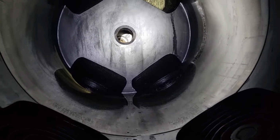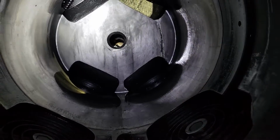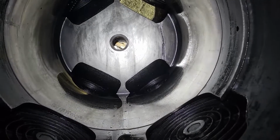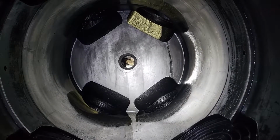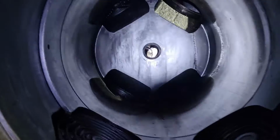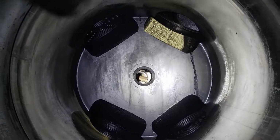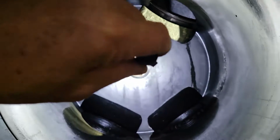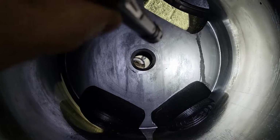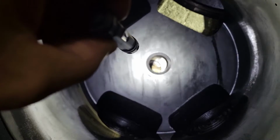The gas compressor is just one massive cylinder, and so what you're looking at there is the inside head of that. Your compressor rod slides through that hole that you're looking at, and your pressure packing then is on the back side, the other side of that. The rod for your compressor slides through there and connects into your scavenging air piston back in there. You can just kind of see that wooden block back in there. It's just a spacer to protect that right now.